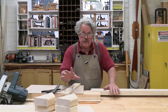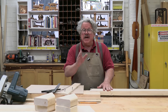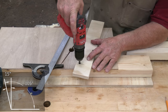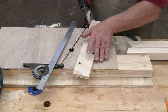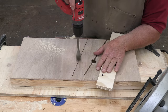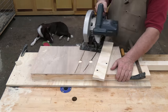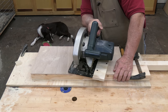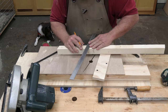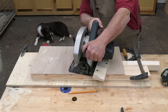Let's set the legs and the spacers aside for the moment and we'll get ready to make the cleats. Now we're going to make these pretty much the same way we made the spacers, but we cut these parts at 15 degrees. Move the fence a few inches to the right or left on the jig, and reattach it to the table 105 degrees from the back edge, or 15 degrees off square. Cut a kerf, and drill another peephole a short distance out from the fence. Then cut the cleats, mitering the ends at 15 degrees. Do not turn the stock over as you did when making the spacers. Instead, measure seven and a half inches or 191 millimeters between each cut, presuming that your rail is seven and a quarter inches or 184 millimeters wide. If it isn't, you may have to adjust the length of the cleats.